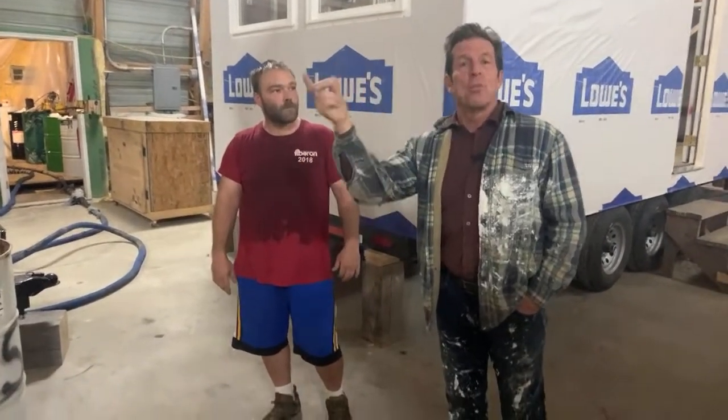He did the floors and the walls, so they didn't have the subfloor on yet, did they? No. And see, that's what we were talking about tonight. There's no subfloor. So he sprayed the floor, the walls, and the ceiling, and now Al will go back and put the floors on. We'll give him 1x8 or decking, the sheeting, whichever it calls for, and then we'll give him the 1x12 for the walls, ceiling, and let it go.